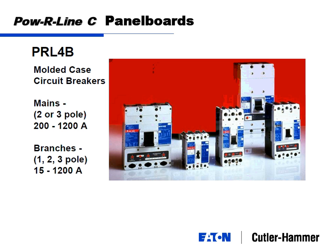But use that to give you a guide of how much space is my panel board going to take. Why? How come I can't fit everything into one structure like on paper it looks it should be doable, and I tell you it's going to take two structures. This is one of the reasons the bigger equipment you have, or the bigger amperages you have, the more space this is going to take up.